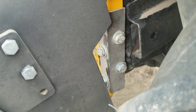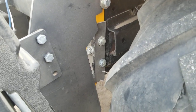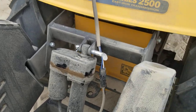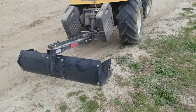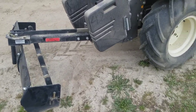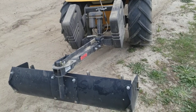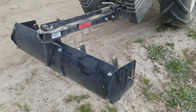Quite often the back plate will develop cracks or bend, so these reinforcements are going to be needed for a lot of tractors, including the Series 2500, which is a fairly expensive garden tractor. Even though it's heavy duty overall, the back plate is just held with four sheet metal screws — that needs beefing up. The main takeaway: just because an implement looks inexpensive doesn't mean that's the total price. You really have to look at the entire package and decide if you want to sink over $1,000–$1,200 into a setup.